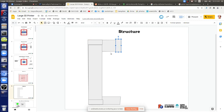No, I mean, you basically need top pieces. Yeah, you're basically just building a tiny wall. So more like this here or something? No, I would do it just like you're framing up a normal stud wall. You don't have to put a corner in for it, because one stud is plenty enough. Yeah, like that, just right at the end.